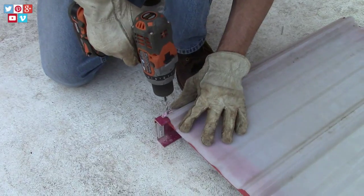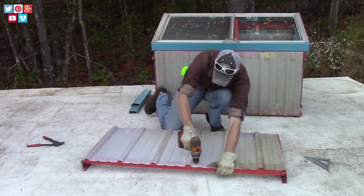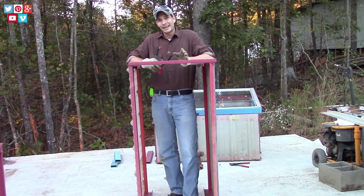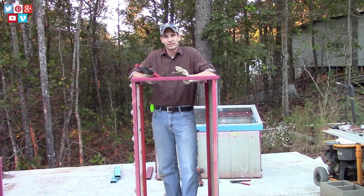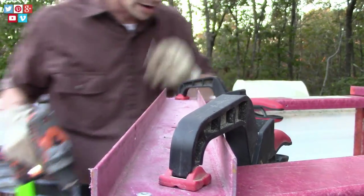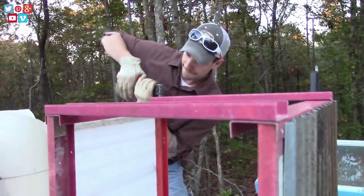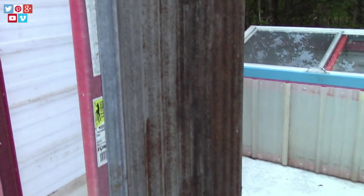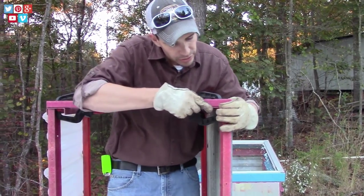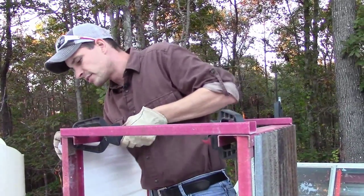Instead of putting metal on the front, we're going to put some translucent plastic material — simply something I've chosen to do to get a little more light into the cold frame. I may change my mind once we get into the season, so this is going to be an experiment we can all share together. Now that we have the back and front done, this is where it can get a little tricky — we have to connect the two. If you're working by yourself, clamps or an extra set of hands is definitely the way to go. If building with 2x4s, you can clamp and screw them together, but in our case we're using fiberglass, so I'll drill our holes and affix the ends together.